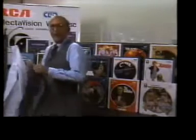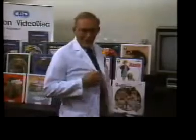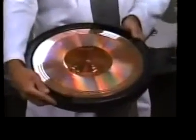Well, in the next few minutes, we'll see how it all comes together. Now, we'll follow the disc production process here at RCA Selectavision facility in Indianapolis, and then we'll tour RCA's player assembly facility in Bloomington, Indiana. You'll understand the reason for this lab coat in a moment. It's required dress if we're going to witness how the television information on this master 1-inch videotape is transformed to the 12 miles of grooves cut into this copper video disc master.